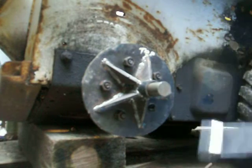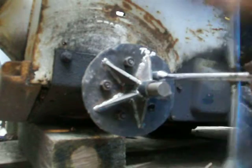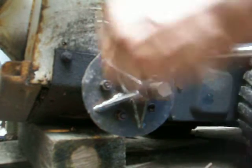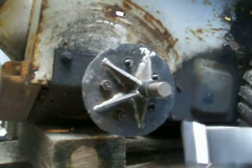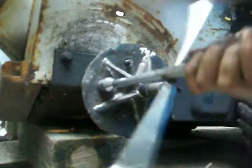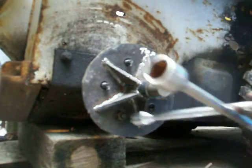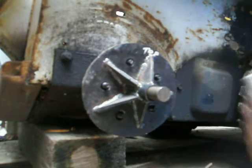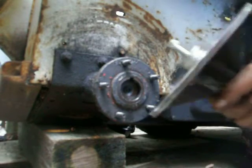I was riding this skid steer on broken bearings for about 3 or 4 months. Trust me, I heard them crunching and grinding in there. The race has lasted, I guess. The axle was riding on the races, but the races rusted. There was no chrome on those races, and I'll show you that in a minute. That means that the bearings were not rolling on the races.